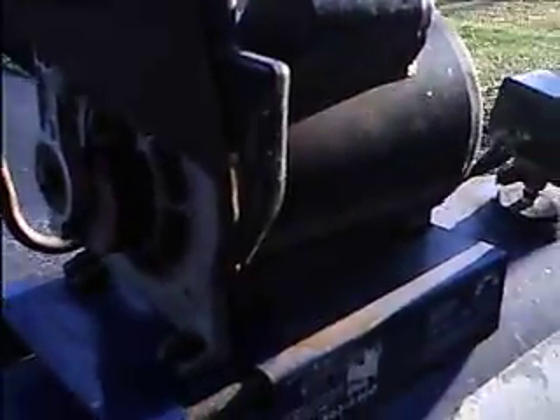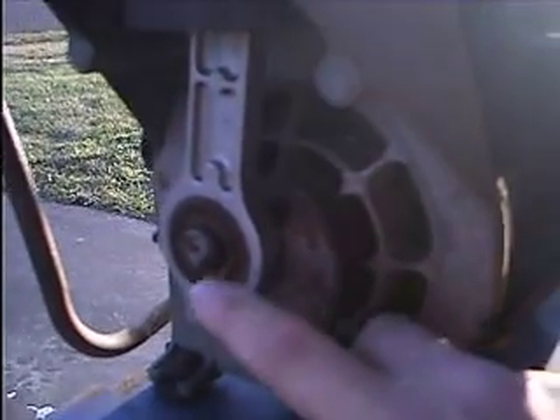Here's the pump. It's a 5 horsepower capacitor start motor. Here's the compressor pump. It's oil-free — an oil-free compressor. It's got one main crank bearing there, permanently lubricated. Just look at the design and tell me you don't think this is just waiting to go wrong. There's no real protection here. The only protection for this area is this little plastic cover here, which goes on like this.